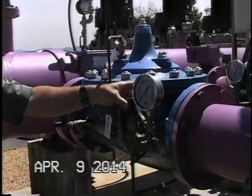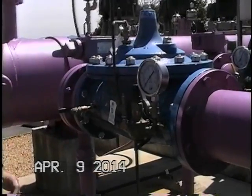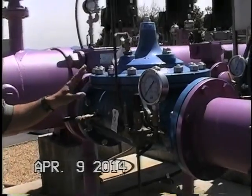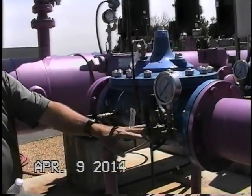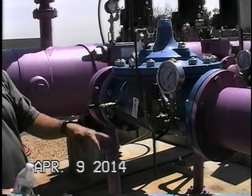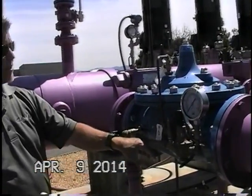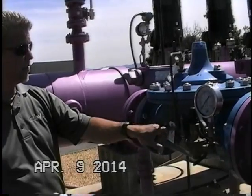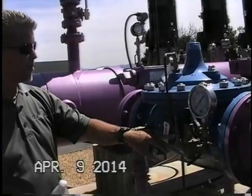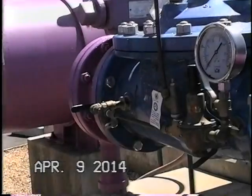And it's set at, you said it's set up for 65? 60 psi. 60 psi. So this is going to our hydro-pneumatic tank. Okay. So the main valve should be serviced approximately every 3 to 5 years, along with the pilot controls. And of course, at the same time, we'll check the screen and the Y strainer. Check also that the fixed orifice restriction is still intact, and check the adjustment, making sure that there's no lime, rust, or calcium deposits in the opening speed control here.